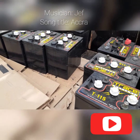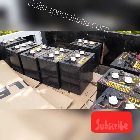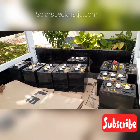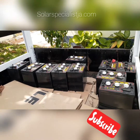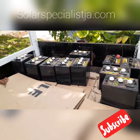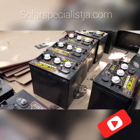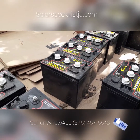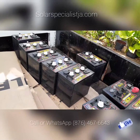When it comes to batteries, your cheapest option is going to be a lead acid battery, and that's probably because it's one of the oldest types of batteries around. I just want to provide some basic information on the three different types of lead acid batteries that we carry. This would be the Trace T115, 6-volt, 225 amp-hour flooded lead acid deep cycle battery — it's the smallest battery we carry and the least expensive. One of the pros is that it's very economical, about a hundred US dollars per battery, and it's very durable, giving you about four to five years with proper service and maintenance.